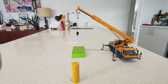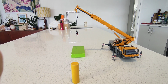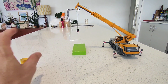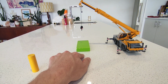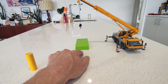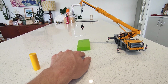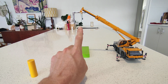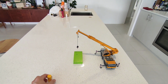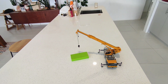Now, this is what happens. You do maybe 10 loads a day and they're all like this. And for some reason, I've done it before, we're all guilty of it, you start thinking that since it's worked 10 times in a day, you should be standing in the center of the load, because it's worked all this time. And center of the load in this scenario is actually 90 degrees from the boom, so correct. But what happens is, next time you pick a load, this load is not parallel with the crane.